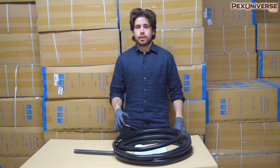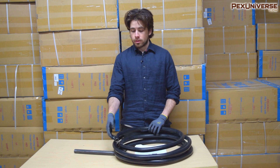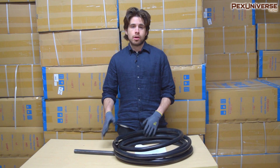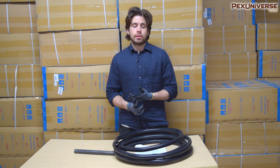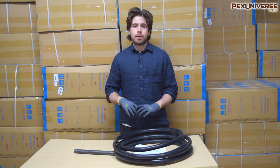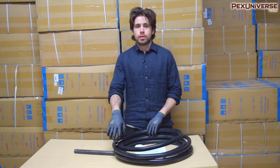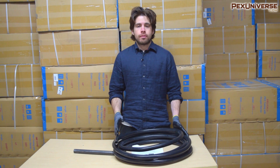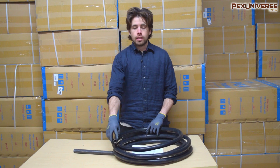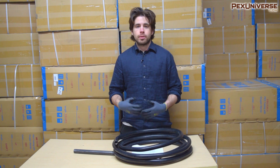The biggest debate about CSST piping is whether it's resistant to lightning. That debate stems from the first generation of CSST — a yellow-coated pipe — which was not arc-resistant and was not required to be grounded. A house with first-generation CSST was struck by lightning, the pipe started leaking gas, and caught fire. This created a huge problem and led to the second generation of CSST. Most manufacturers have phased out the first generation; the second generation has an arc-resistant coating and is required to be grounded, eliminating the lightning problem.